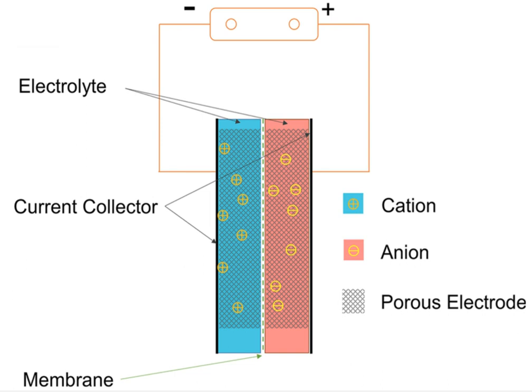Supercapacitors compete with electrolytic capacitors and rechargeable batteries, especially lithium-ion batteries. The following table compares the major parameters of the three main supercapacitor families with electrolytic capacitors and batteries. Electrolytic capacitors feature unlimited charge-discharge cycles, high dielectric strength up to 550 volts, and good frequency response as AC resistance in the lower frequency range. Supercapacitors can store 10 to 100 times more energy than electrolytic capacitors, but they do not support AC applications.